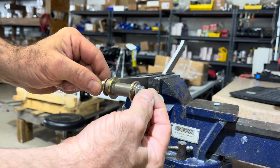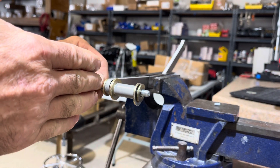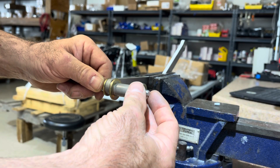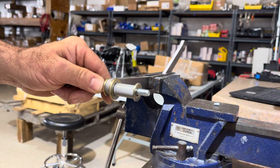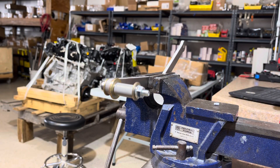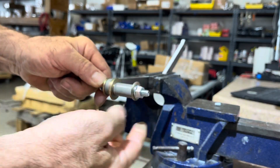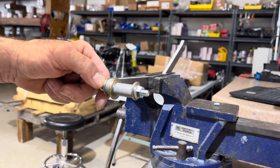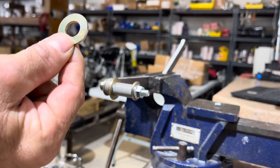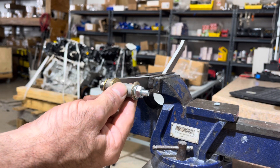You just did this to the whole thing, so really it didn't work. Since I've been talking about this side thrust of the flap somehow moving out or moving in — which it won't, especially with three or four attach points — let's take one of these thrust washers out and put it back together. The thrust washer is about the thickness — let's say that compensates for the paint. Then we tighten this back up, and we still have this nice and rigid, and this can spin. Moral of the story: all you really need to do is take one of these thrust washers and get an L washer, a thin washer. Put that in here instead of a thicker washer, and that takes care of the fact that there's paint on this, and this can rotate freely.